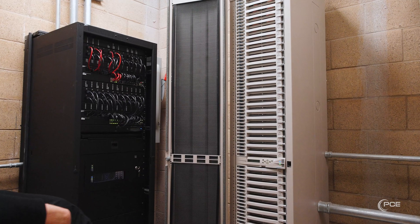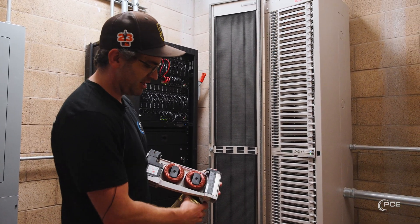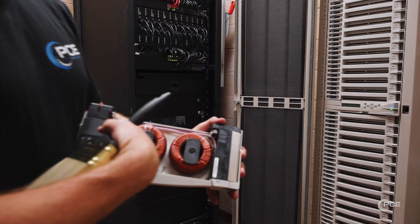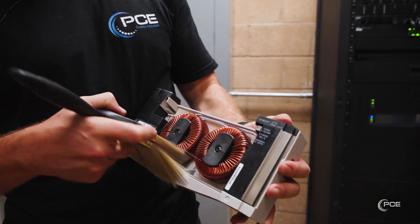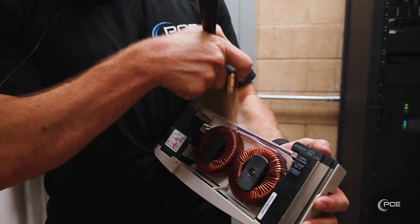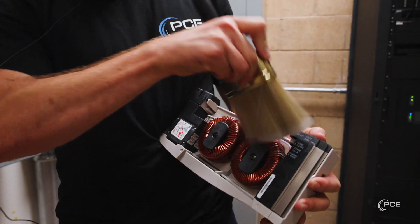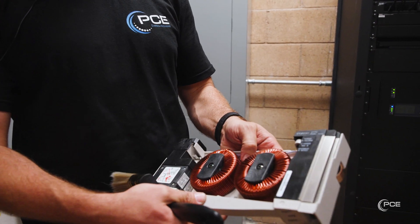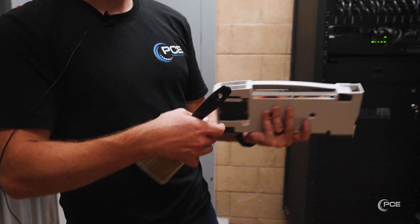To show you what you can do on some of your older cards — you'll start getting dust in here and around your choke coils. What you'll do is come in with a paintbrush, do the same thing, clean them off, give them a nice little dusting, and you're good to go. Then pop it back in.